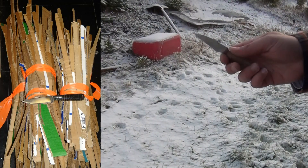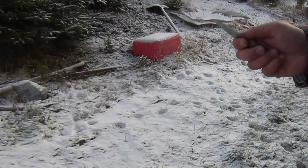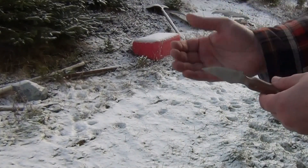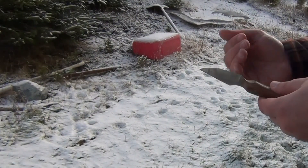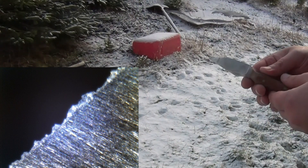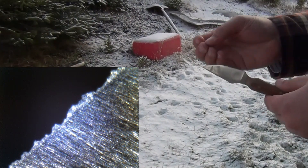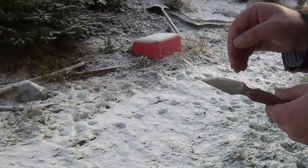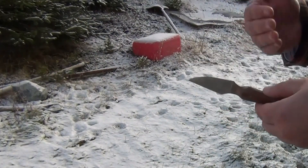What I've found is that burr minimization is a lot more critical than I previously thought. Once you sharpen a knife initially and get it to come to an apex, if there is a visible burr you have to remove it before you sharpen — if you don't, the edge retention is likely to be quite poor. The steel even under the burred part is still damaged, because the burr is just steel that weakened and collapsed. It can't hold that triangular taper and just collapses at the very edge, and that's the visible burr you see.